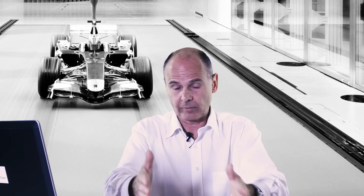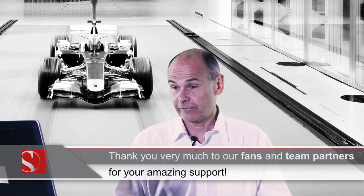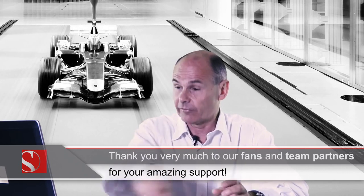And we don't use that technology in our tunnel, but it's a really good technology and allows a team potentially, or a wind tunnel manufacturer, to make a slightly smaller wind tunnel and use this technology to correct for blockage rather than just make a nice big one so the blockage correction is smaller. And that's the fundamentals, if you like, of the design of a wind tunnel.